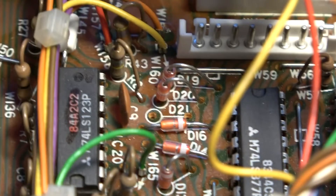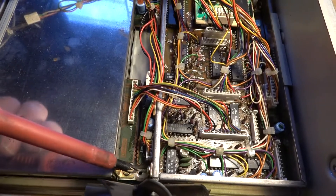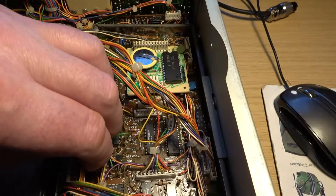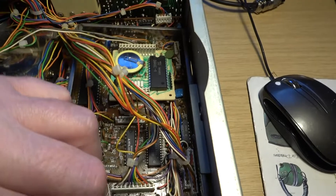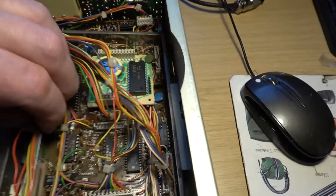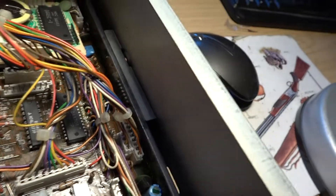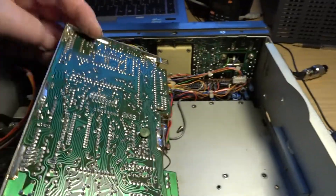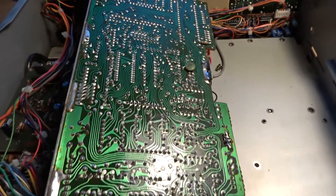It's easy enough to remove the box. There are the diodes there. There are two screws — I've taken one out. There's one down there and one up there. Once you've done that, just a slight lift and a little bit of a wiggle, and the whole module just pulls forward. There's a bit of a lip just there we've just got to get over. There we go — we've lifted it across the lip. And here's the back of the board. Simple enough to do. Let's get a soldering iron on it and move it across, then we'll give it a try.